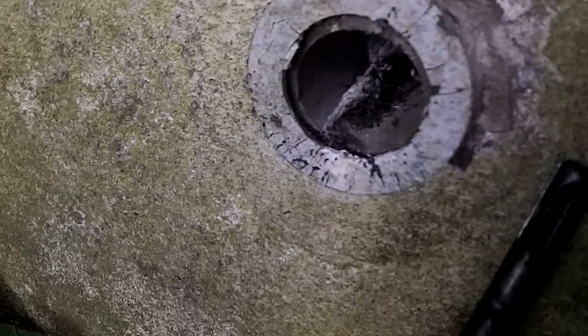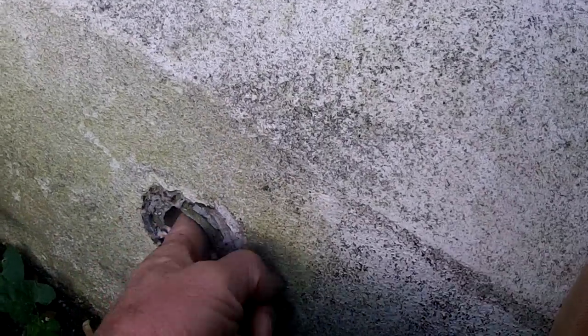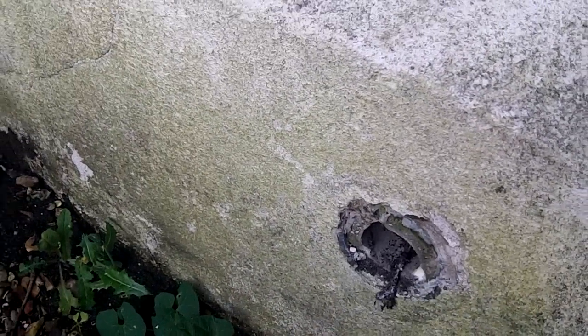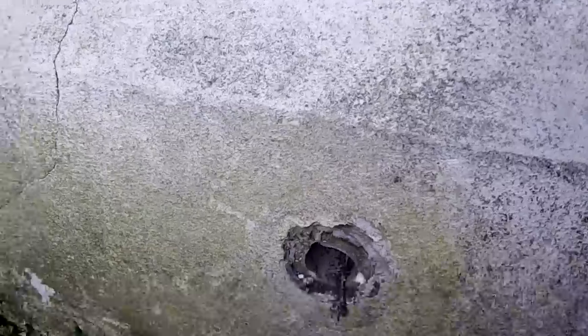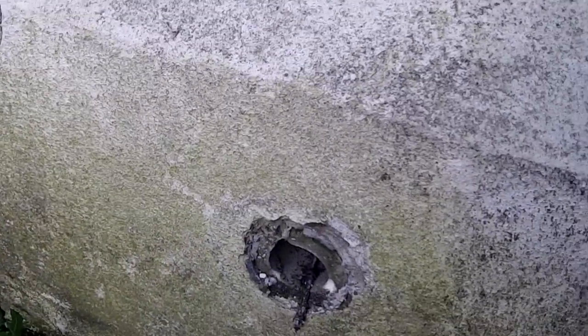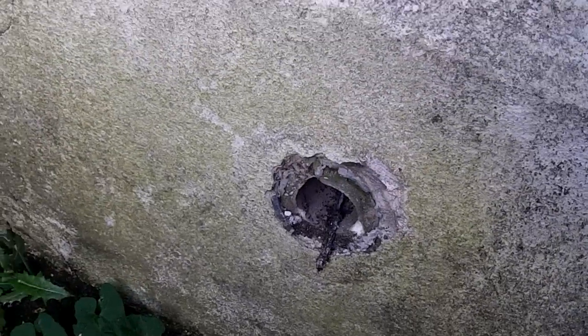What I think is so funny about these — they have these tubes, and the theory is that they are put into the wet brickwork and because they are in wet brickwork there is a hole in there. So this hole is supposed to evaporate water from the brickwork. That's the theory behind them. There's only two things wrong with that. What's wrong with just taking this cement render off here and letting the brickwork dry out? But oh no, we are going to make lots of money out of the unsuspecting public because we are going to put these wonderful inventions in. So we chuck them into the brickwork, when all we actually need to do is take the cement render off.